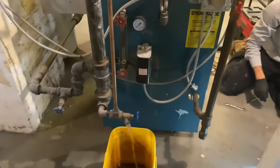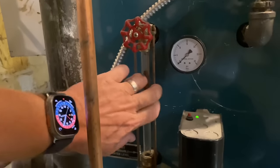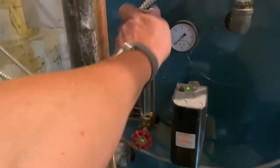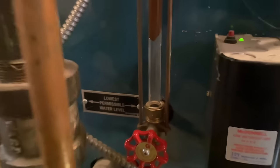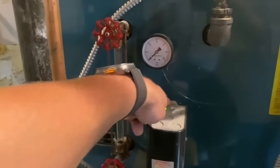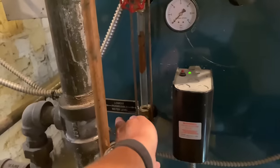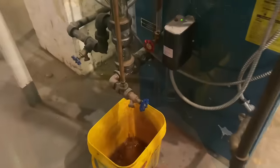The red light went on because we still had water present in our sight glass, which is kind of dirty — we're going to want to take that out and clean it. But first, let's make sure that red light comes on and make sure our valves are open. Also notice that the 'lowest permissible water level' marker is in the wrong place — it should be up here. If the water level is down there, the system's not going to work.